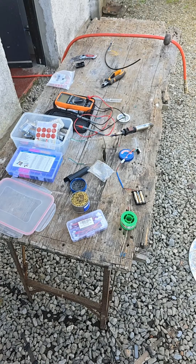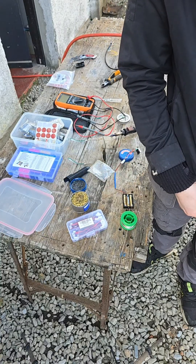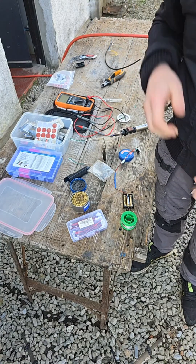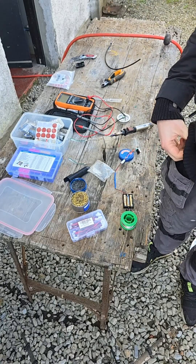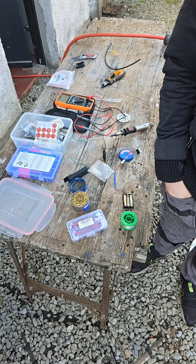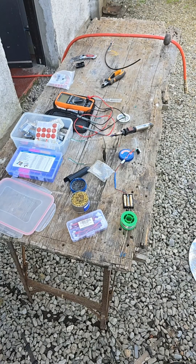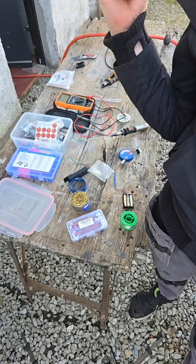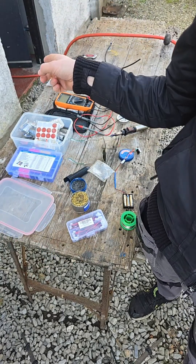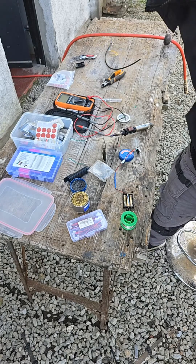So what I'm doing today here is making up a circuit that I can switch between two different master sockets. I've already started it here but I just thought I would do a wee live stream on it. I contacted BT a week ago and asked them about having another router at the house, another socket on the line. But you can't have two master sockets on the one phone line — I've tried it and it actually affects the signal. So what I'm doing today here is making a switch to switch between the master socket in the house and the socket in the garage, so that I can get better internet for the project videos.